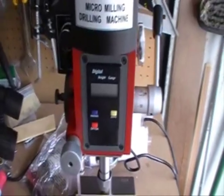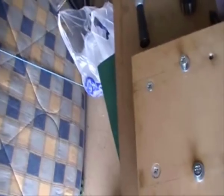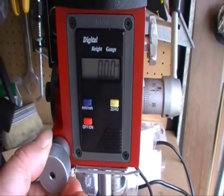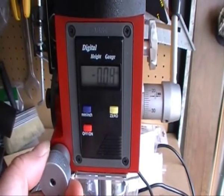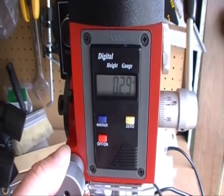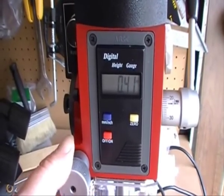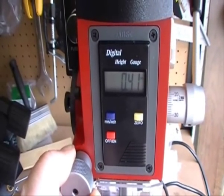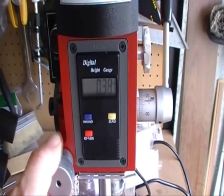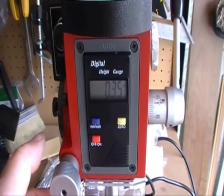I might as well show you the fine feed now. The picture is going to go a bit naff because I've got to pull the handle forward whilst engaging it. That should be the fine feed engaged. So you would zero that, get that out the way, and then you've got that — that controls it. So you can turn that to really fine feed to whatever depth you want to mill off. It is quite stiff, but that's because it's got to overcome the return spring in the arm. But you can take it off and if you go carefully you can adjust it at 0.01mm at a time.